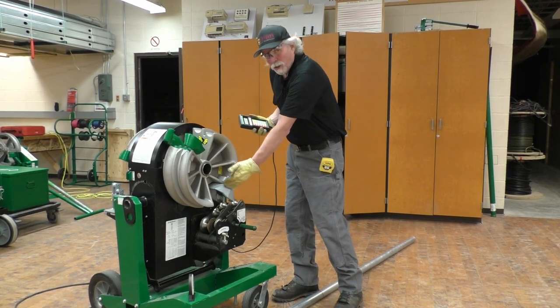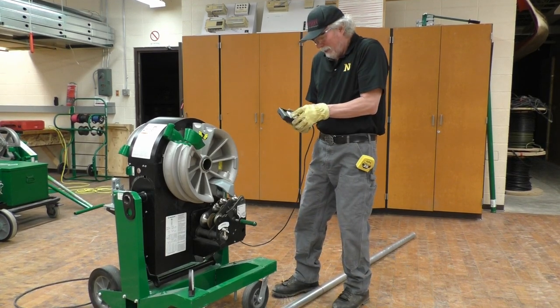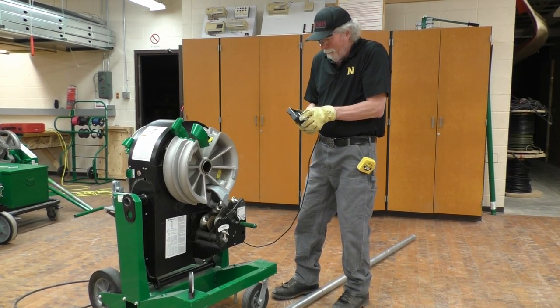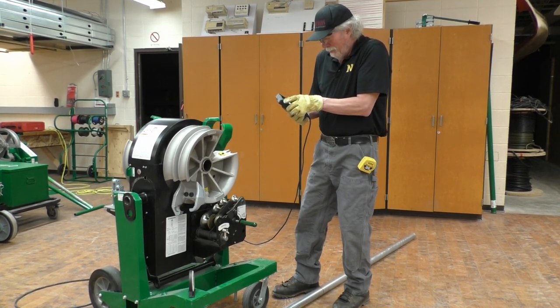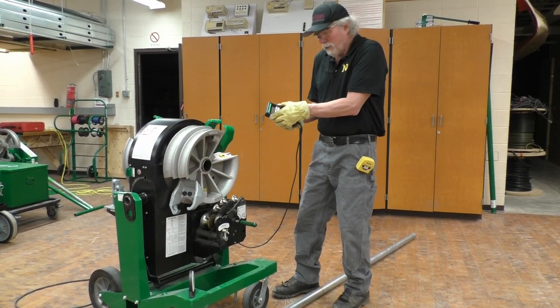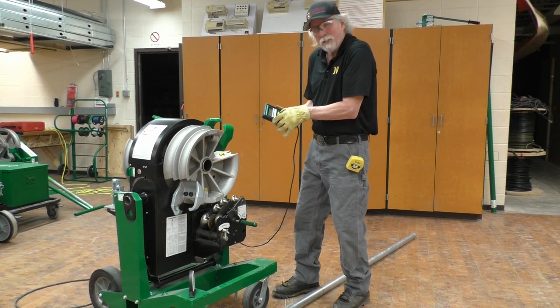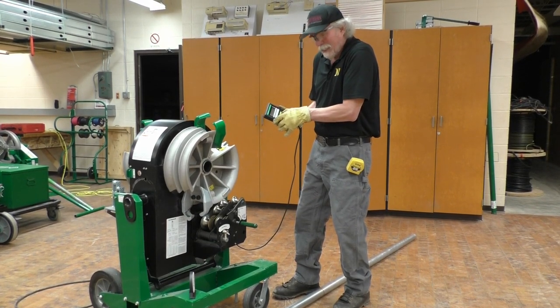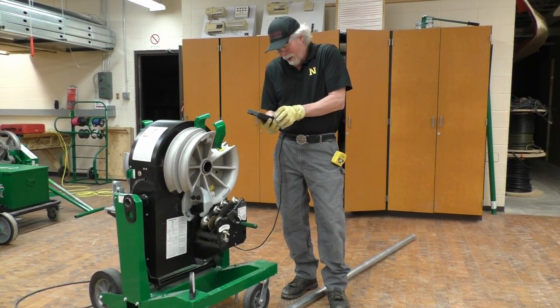Until the hook of the shoe is at about the 5 o'clock position. Then it says bend, so I hit bend, and it'll start to read degrees. Up to 7 degrees, a little slower. But anyway, 7 degrees, so we hit bend, and then when I hit unload again, it should stop in the home position, and there's home. So we're ready to go to the type of bend.